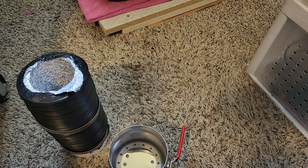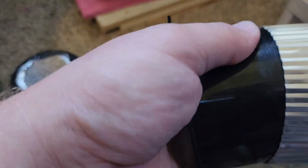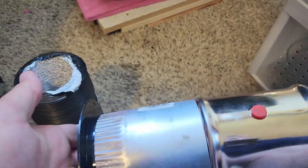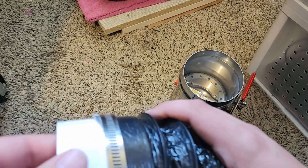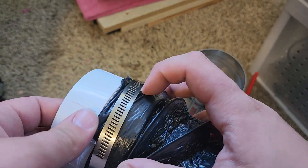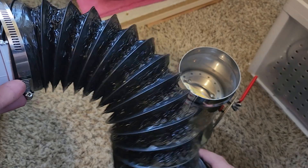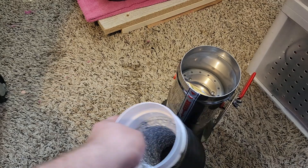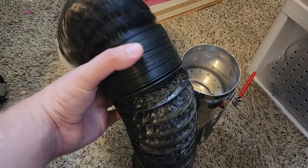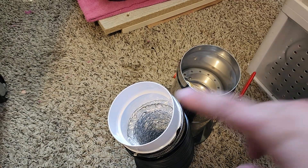To get this connected to the AC, metal and plastic don't go very well together, so I found this plastic 4-inch duct adapter. This will connect it to the valve. For the hose, it's an insulated hose — it came with two clamps. The first clamp I already put on; it barely fits but squeezes just perfectly. I don't really care for this hose design too much — it's a insulated duct hose used for dryers, and it's very flimsy. But thankfully it's only going to go about a foot. I decided to get a 16-footer just for the density and flexibility. With all that in mind, the first thing we need to do is cut a hole in that back panel and get this piece sealed in there.